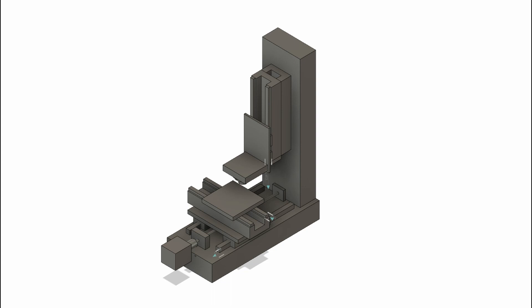There are bolts that will go through the base and into the column. To get those bolts to actually fit in there, I need to countersink them. Although I was able to drill through the base on my drill press, I couldn't countersink it for the bolts. So I realized I needed to use the mini mill itself to cut the countersinks.